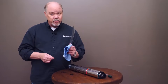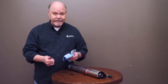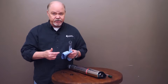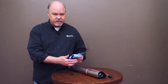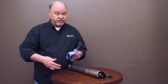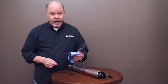Another tip: you should always have an extra quartz glass sleeve on hand. Quartz glass works great, but it's incredibly brittle — it doesn't take much to crack or chip one. If it's broken, you won't be able to use the system and you won't get disinfection. That's especially important if you have to bypass the system because your quartz glass sleeve is broken but you still need water in the house.